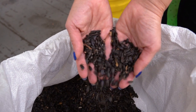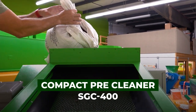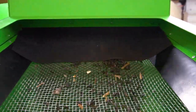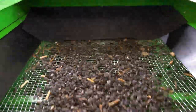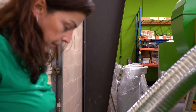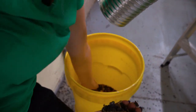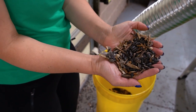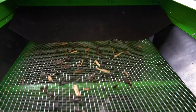So let's see what we can clean out of this to make it even more pure. We put it through the pre-cleaner — this is screen number six, a six-millimeter screen. We can see how the bigger chunks are coming out of the supposedly clean sample. Let me get some more so we can see better. Look at this stuff — again, this is after it's already been run through a cleaner from a different manufacturer.